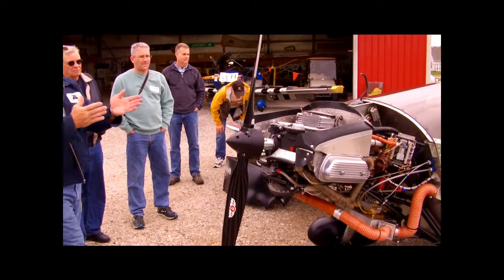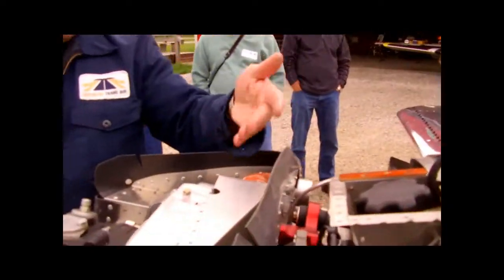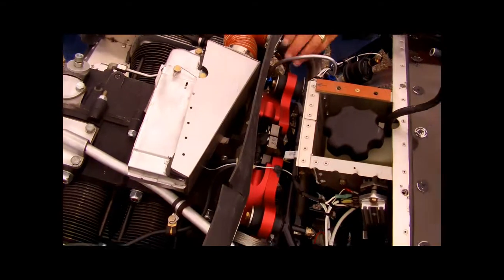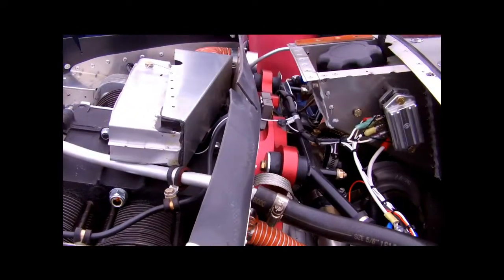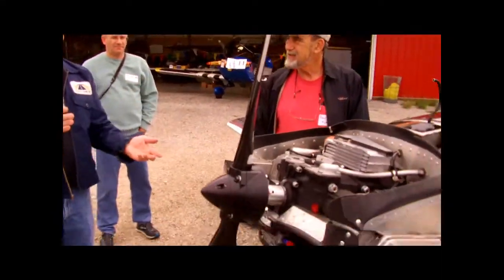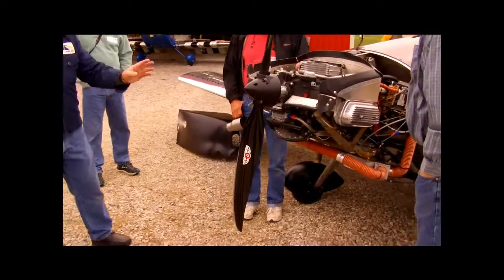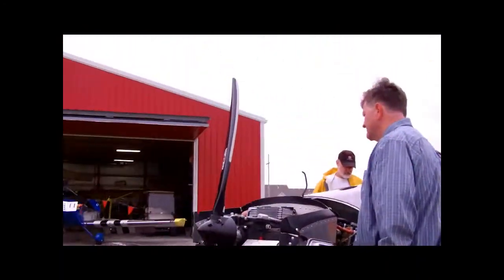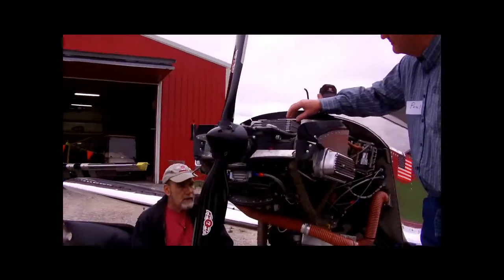The baffling kit they sell with this has actually opened up completely in the back. I even experimented to use the heat from this to go into the cabin, but it doesn't work — it's kind of a catch-22. Buy yourself some ski bibs. I got an electric jacket now. But I have gotten heat muffs and I mounted two muffs, and they are excellent. You can see it's all plumbed for cabin heat. With the two heat muffs, there wasn't a day in the winter I couldn't keep warm.